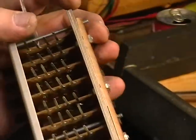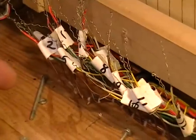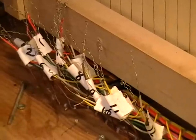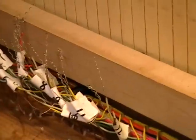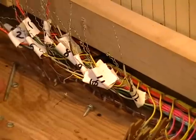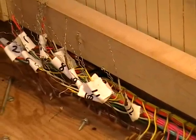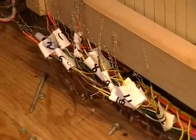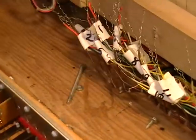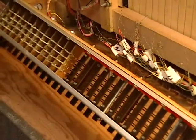Because this was such a short harness with such short wires — some of them burned because somebody had tried to change other contacts and burned the wires and insulation right off — what we're going to do is add about six inches of wire so that next time the technician can take this whole assembly out and work on it, with the wire long enough to reach the harness without having to tear everything apart again.